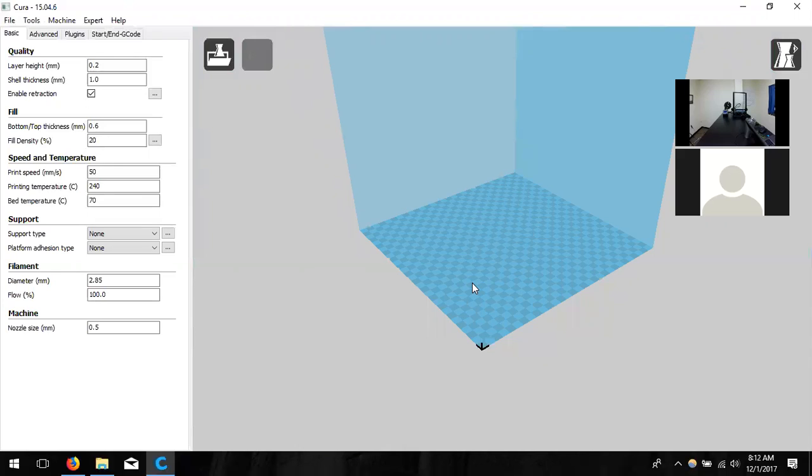Actually, we may want to make two different printer profiles because one of your printers has a nozzle upgrade, and that's going to change a couple of things. The nozzle upgrade is what you'll use for the carbon fiber and conductive TPU filament. Is that the 1.75 nozzle? No, it's the 0.6 nozzle — that's the upgraded version. The one with the yellow feeder is the one with the bigger nozzle; the other two are black.